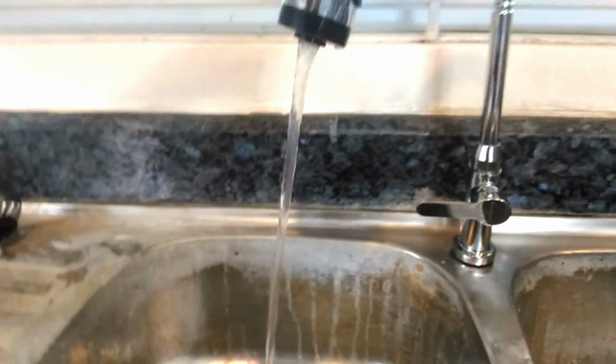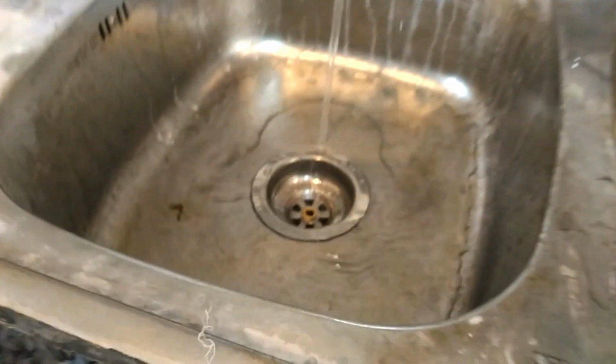Let's swing this to the left to test our left sink drain. And inspect underneath to check for leaks. Our sink drain housing and the seams, dry. Slip nuts, dry. Water inlet, dry. Flexible hose to faucet, dry. Bottle trap and other fittings of the entire drain system, dry. Fantastic!